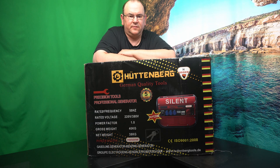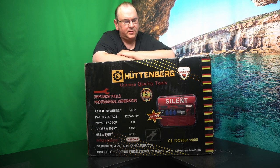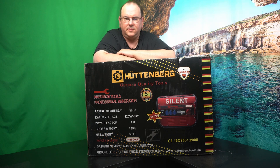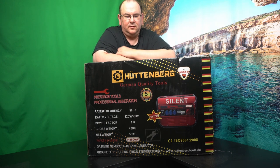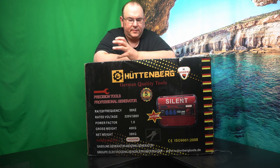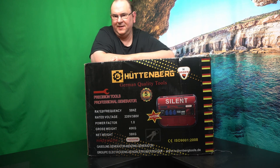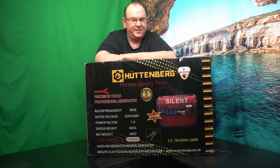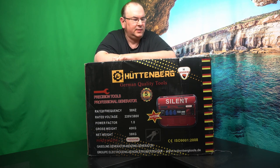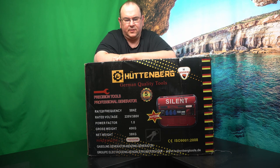When it comes to sizing generators, I've read quite a few articles about what size of generator you would need for different types of welding equipment, and the reality seems to collide with theory, because you would probably need to have like a 10 kilowatt generator dedicated on a single phase network to be able to actually handle all possible scenarios of welding. And then on the other hand, I've watched so many videos about people running welding equipment of all different categories, including plasma cutting, remotely off-site on very small generators.